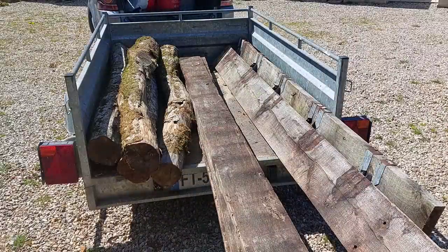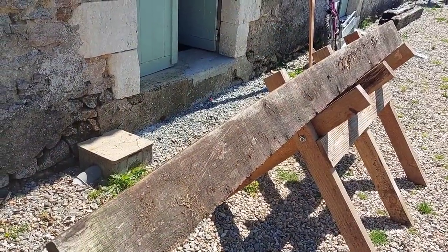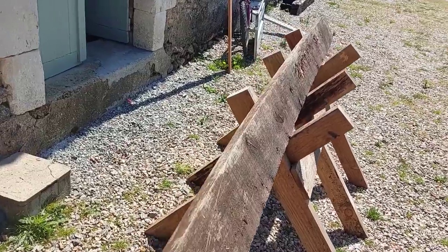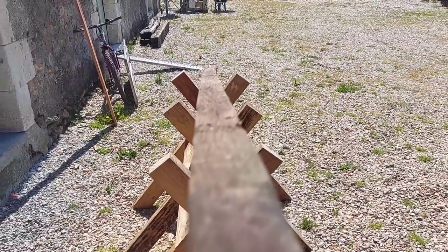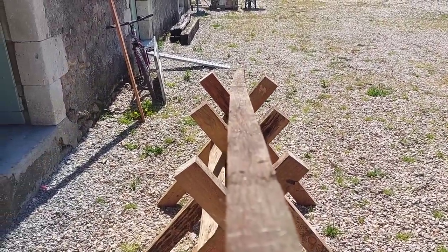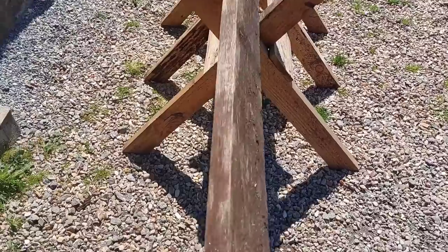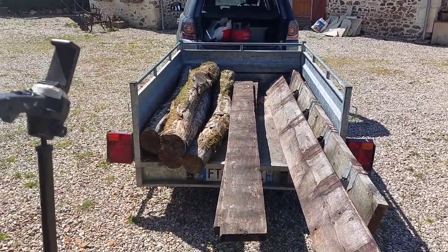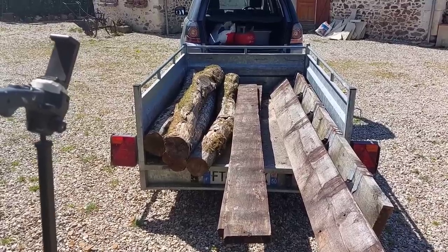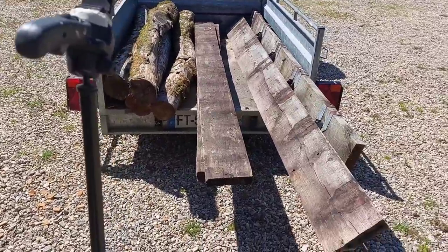Reusing old wood. Let me just show you what happens when you try and do that and deal with all the weathering that they've had. A quick tip here, when you go to the DIY stores to buy timber, is always look down the length of the timber like you're looking down a rifle iron sight. Now if I hold this down, look, can you just see how wonky that is at the end where it's warped? So if this was going to be the side, it'd be dreadful, because we'd be dealing with something which bananas out. So that's not going to be any good. So my first job now is just to select two decent lengths to be my sides. This one can probably be okay to cut for the ends, because in half it won't be so bad, it won't be so pronounced.